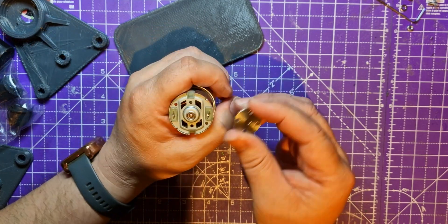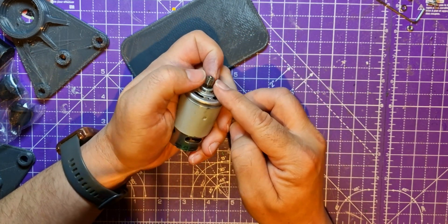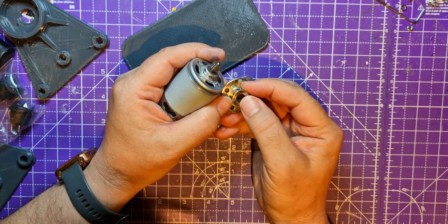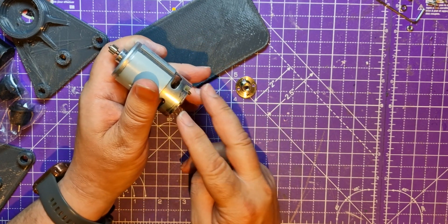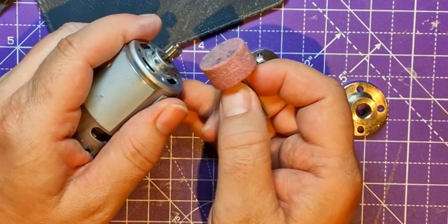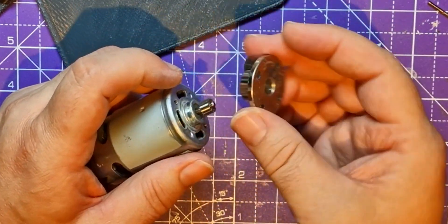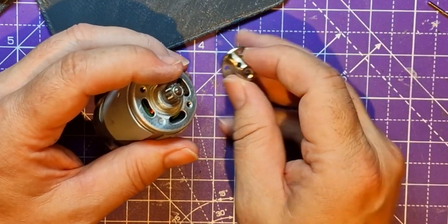One of the things I bought was this little flange to connect onto the motor. The idea was to take this cog off and connect the flange to it, but I couldn't get that cog off - I put something underneath and tried to prize it and it wouldn't budge. I found on eBay you can buy bigger flanges, so I bought the biggest one - about 8mm - and the cog was about 8.6mm. What I did was power the motor up another way, get it spinning, and put a grinding wheel against it - a little grindstone - to wear down that cog enough to fit the flange on. Then I tightened the two grub screws.